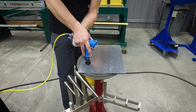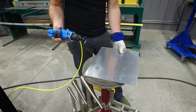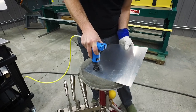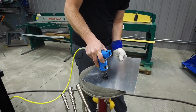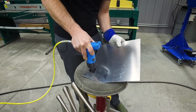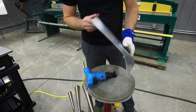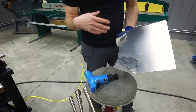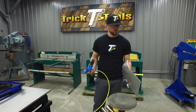You can adjust it out to achieve some different hammering. We're going to hammer into a shot bag to show you some of the shaping it can do pretty quickly. You can see that makes pretty quick work of putting some really rough shape into something. We're working with 0.063 3003 aluminum.